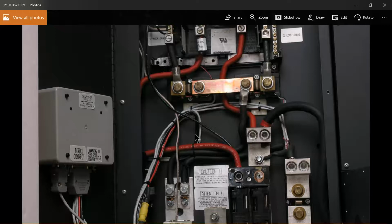And the Kid does have its own fusing on board, so the code would say that those fuses do not meet the requirement for a disconnect. I would think your safety pull would, while still having the fuse in the Kid adequate for protection of that device. So you can stick with your number 10, which is what the Kid is wired with, as long as you're going to mount the Kid essentially on the cabinet.